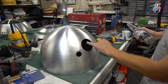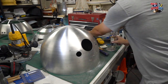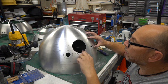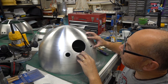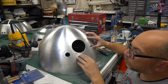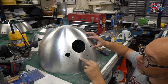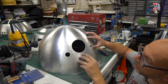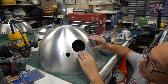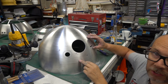You can just eyeball it, just take it beyond this black mark, which will probably be fine. And once that's done, then this will line up nicely, and we've got, just to show, 1, 2, 3. There we go. Apart from the slight enlargement of the holes, that's best to leave once you've assembled all the dome and you know where your final position is for your panels. You can adjust, because it may be slightly over to the right or left, and you may only need to take this part off and move that a little bit. But yeah, thanks for watching, and that's how you cut a dome.